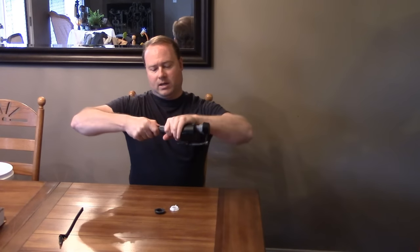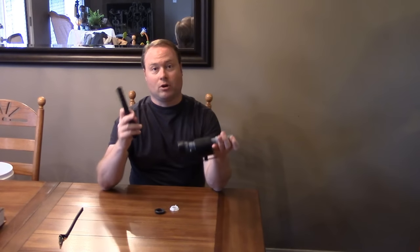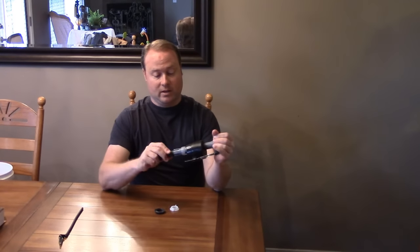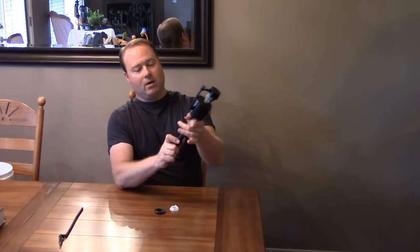To do the coarse adjustment, there is a locking ring right here which you're going to pop. That way it allows you to kind of unscrew this. It takes a little bit of an oomph on the brand new ones because they kind of stick a little bit. Now that's a trick right there — you do want to yank this off. You can put it right back on, stick it in for adjustment, pull the ring up, and click it into place. You can yank it right off. Because once you have this installed, if this gets clogged up with hard water deposits or decides to fail, you can yank that off, grab another one, stick it on the post which is already there, and you're in and out in five minutes or less.